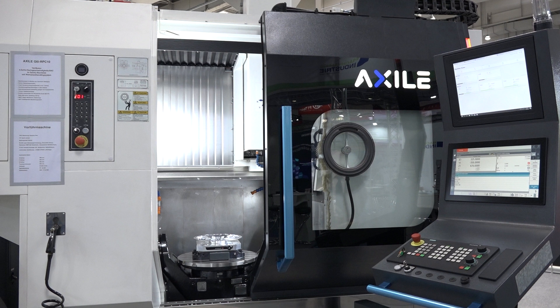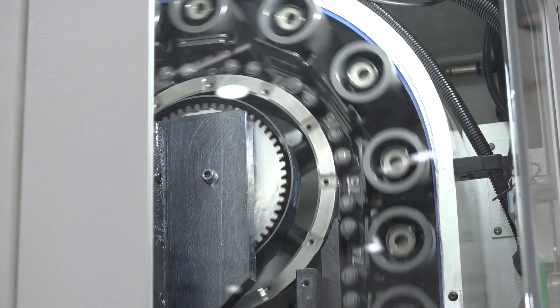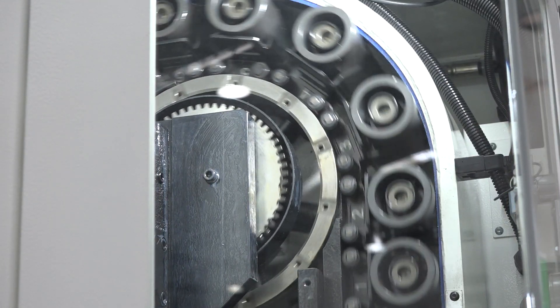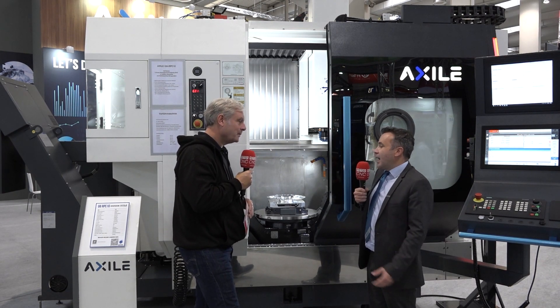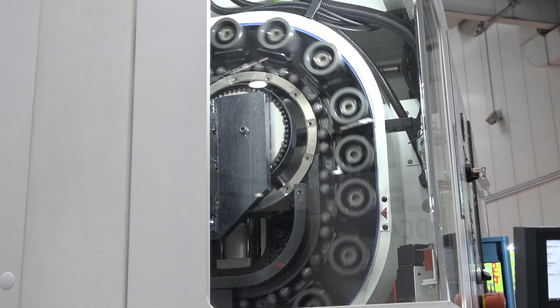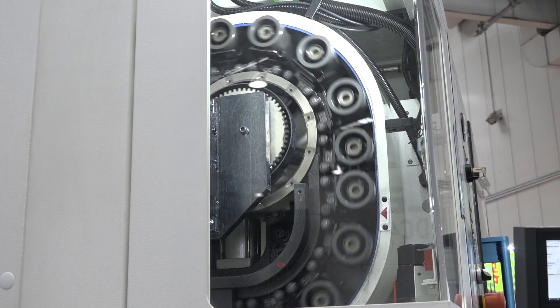You've got lots of capacity, so you're going to need lots of tools. Exactly. In 5-axis we feel it's very important to have the right amount from the beginning, so the standard is 80 tools, and then we can extend up to 360 tools. That really depends on the automation, the number of pallets available, and the complexity of the jobs. If the jobs are complex, they need more tools and sister tools — that's also a point to consider when talking about automation.